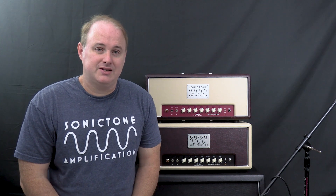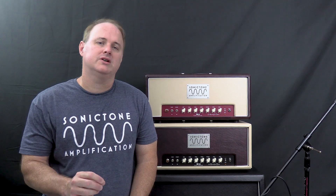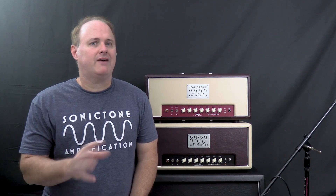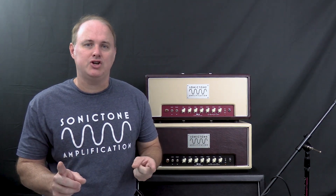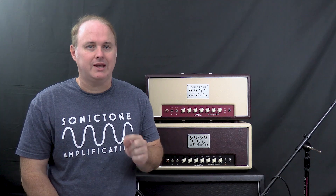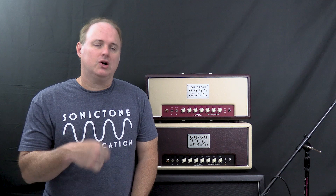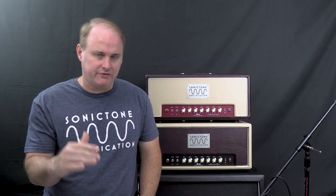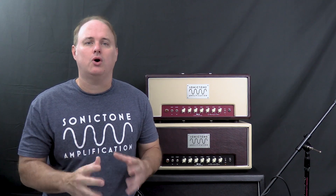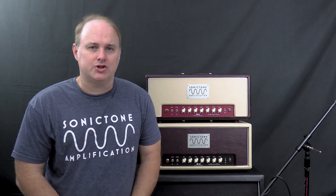It's funny I mention that because there have been amps marketed to have a switch on them that switches them into Class A operation. But if you take a close look at the schematics, it looks like all they're doing is switching it from fixed bias to cathode bias. I think people are a little cavalier with cathode bias and Class A and use them interchangeably. Yes, Class A amps are usually cathode biased, but a cathode bias amp is not necessarily running in Class A operation and may be running in Class AB operation. Also, a closer look at the schematics shows there's no device that lowers the voltage for the Class A operation. Class A amps usually have lower voltages to the tubes because the tubes are on all the time, and if they're getting the high voltage required for Class AB operation, they'll probably fail in short order.